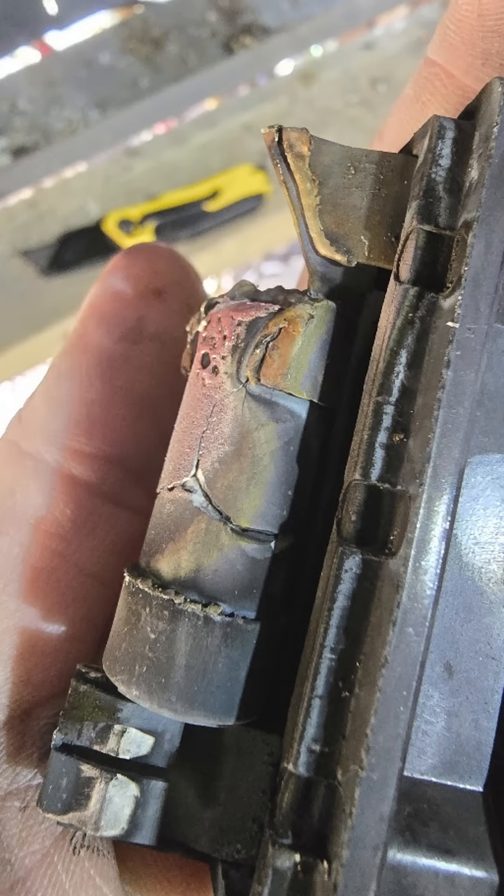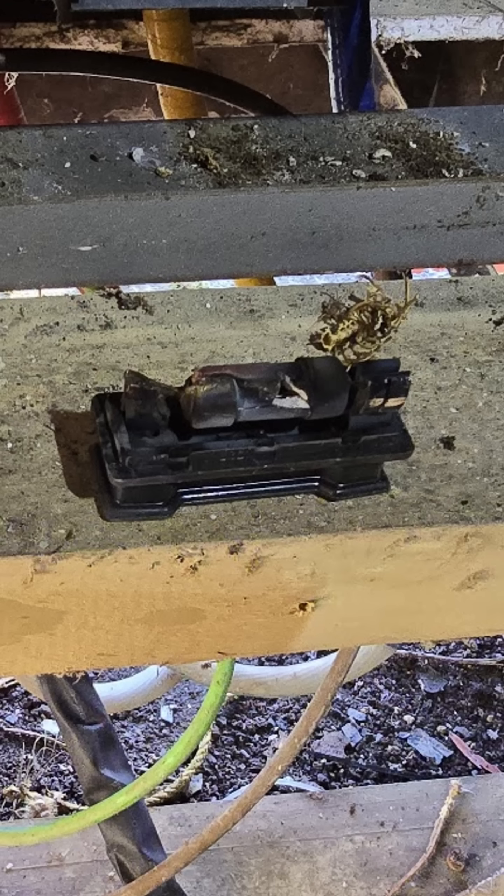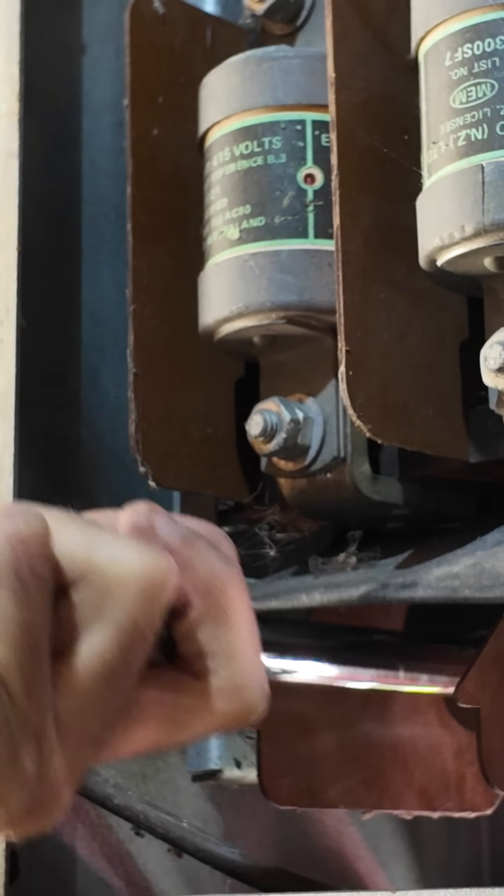It's the fault we attended a few weeks ago. Following a lightning strike, a short developed on this fuse holder. You can see how bad the blowout is in the back of this board. I think the lightning busted through the back of the fuse holder, acting like a spot weld and creating the short.